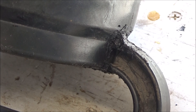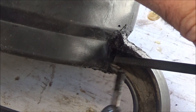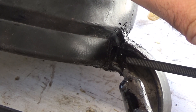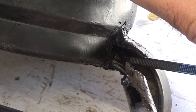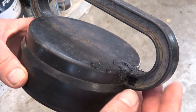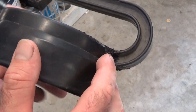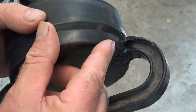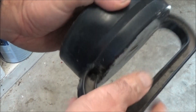Now I'm going to try to fill that little gap — bring in our filler rod, just melt a whole bunch of it in there. Make sure that you melt the original plastic and try to join them together. Here's the finished product. You can see that it's not perfectly smoothed out, but I've gone all the way around this and made a very, very solid repair. I don't think that's going to come apart.